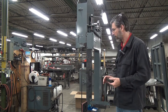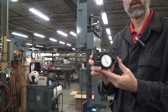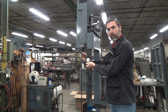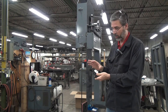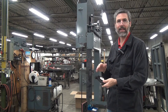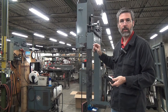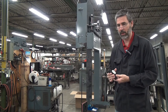So how do we measure this? We measure it with elongation, and you measure that with a blade tension gauge. Here is the best you can get — this is a Starrett blade tension gauge. These clamp onto the blade and actually measure how much the blade stretches. The way the math works out, how much it stretches always translates directly into a blade tension in terms of pounds per square inch. So a quarter inch blade or a one and a quarter inch blade — if it elongates by, say, four thousandths of an inch, it will have the same pounds per square inch tension on it regardless of blade thickness. It's a nice way the math works out in your favor — usually math doesn't, but this time it does.